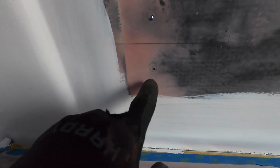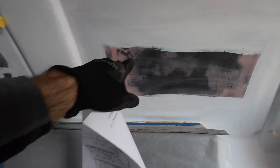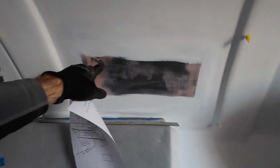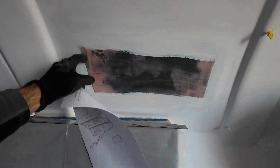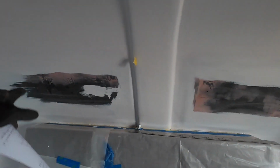And I think you guys can see these little holes. There you go. Those are the pilot holes for the 4.5 inch hole saw, which will cut the 2 1/4 radiuses around all these rectangle windows. So now they're in effect marked on the outside.